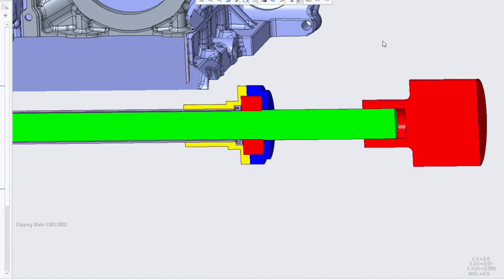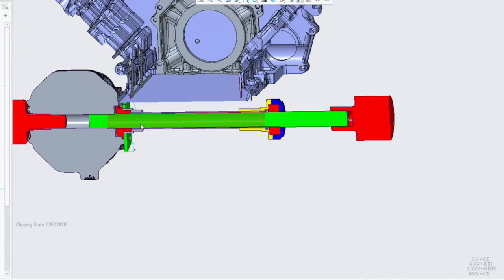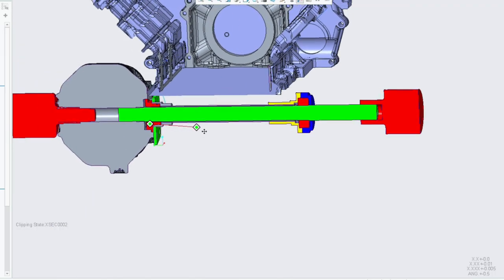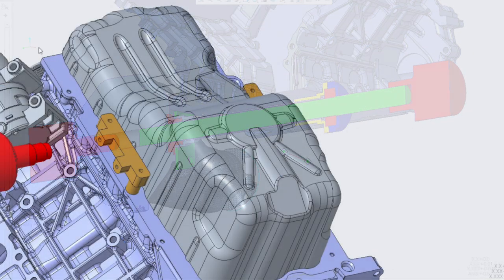That cantilevered design was a stumbling block a couple years ago, but I had a breakthrough when I noticed the newer Kia Stinger all-wheel-drive models have the jack shaft arranged the same way — sticking out well past the bearing, with the bearing close to the oil pan — for the exact same reason of gaining clearance.